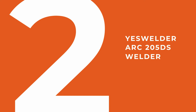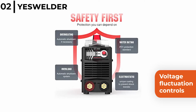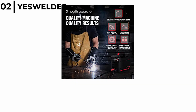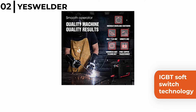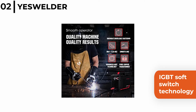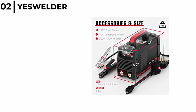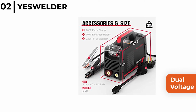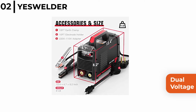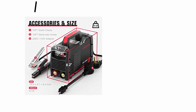Number 2 is the Yeswelder Arc 205DS welder. This welder has automatic temperature and voltage fluctuation controls. With overload and current protection, it has an automatic hot start for an easy, quick start to any welding job. It has IGBT, soft switch technology and auto-adaptive arc force for stability. Plus, it is powerful with up to 205 amps, so less splatter or post-weld cleanup. Plus, weighing under 10 pounds, it is compact and perfect to take wherever you need. The Yeswelder Arc 205DS welder is dual voltage, connecting at 120 or 240 volts. It is ideal for most 6010, 6011, 6013 and 7018 rods. It gives flawless results on a wide range of electrodes such as cast iron, steel and metal sheets.